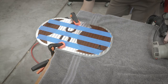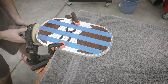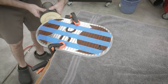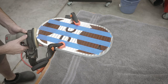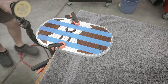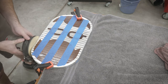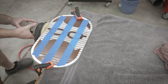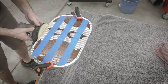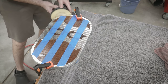Now that the back is finished it's time to move on to sanding up the sides. The sides are not that difficult but they're a little bit awkward because it's just a long skinny track all the way along the outside. I'm just clamping this to the edge of the table and using the random orbit sander around the edges. Because of the machining marks along the outside I decided to start with 80 grit just to remove the vast majority of those. I made sure there were no visible lines before moving up to the next grit.